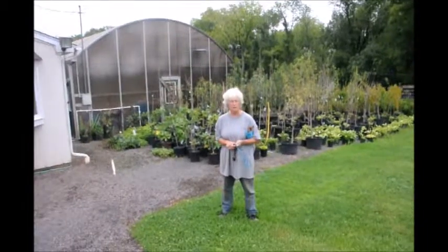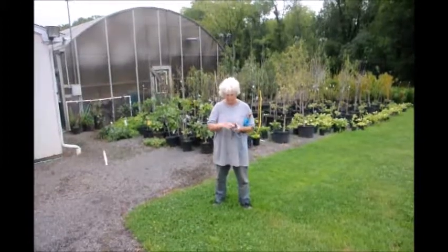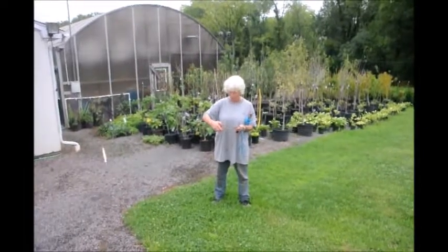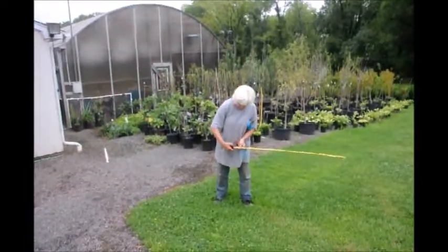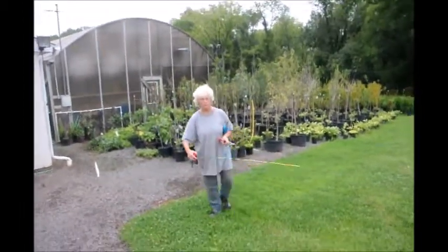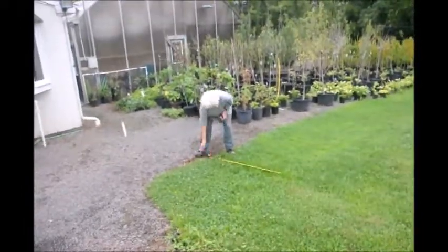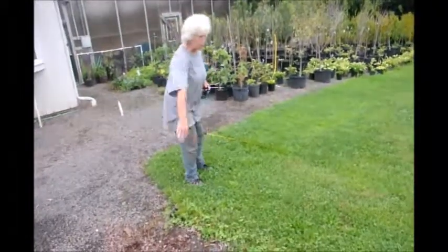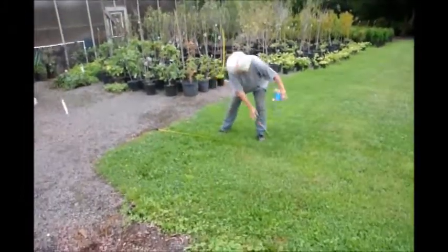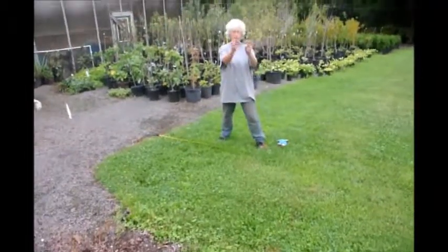So that you don't have encroachment, you will calculate about four feet from the edge of where you want to start. I use my tape measure, pull it out to four feet, and I like to lock it at the four foot mark so it doesn't slip on me when I'm working. I start here and judge down a little bit, because I need to be four feet off of this edge and also four feet off of this edge. So I'm just going to rough guess down this way and then check. That's four feet off of the edge. I'm using a screwdriver because it's easy to move around.